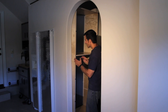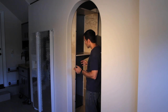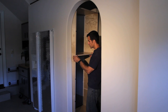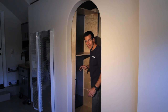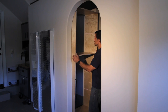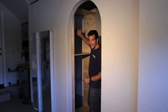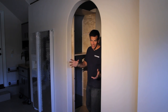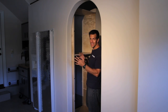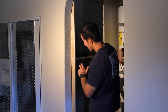Always test fit your cabinet. Before I had all the shelves in, I pushed it into the space to check the fit because clearances were going to be tight. Good thing I didn't have all the shelves in — to get the cabinet in, I had to remove the center shelf because there's a recirculating pump that sticks out about an inch and a half. With the shelf out, I could just squeeze everything in. If you've got a really tight space, always double check that the cabinet carcass fits before you fully assemble it.